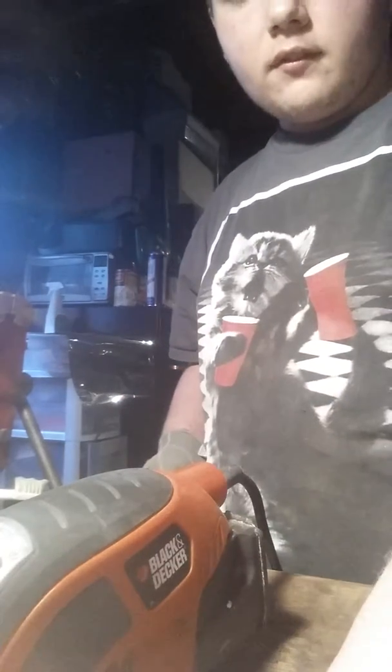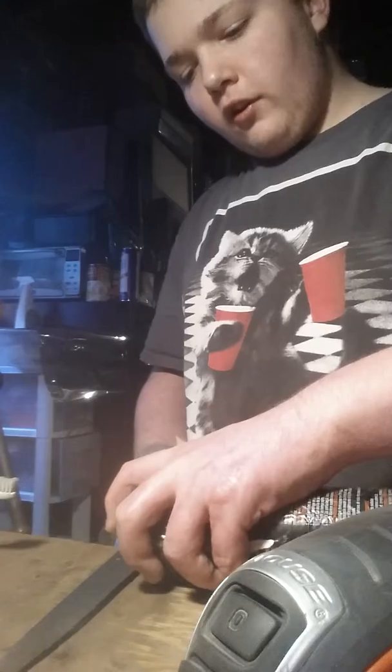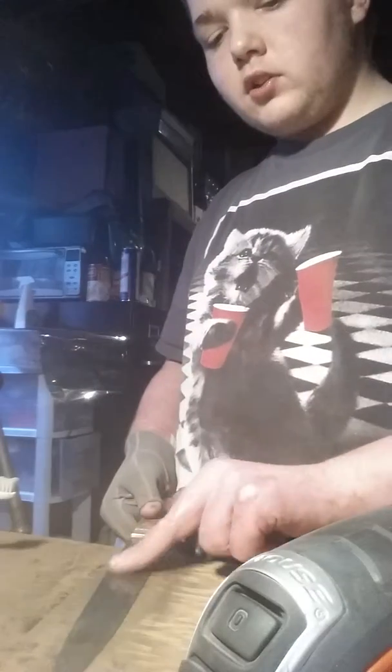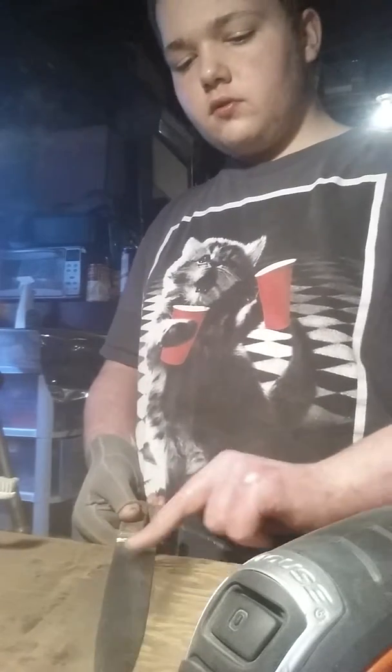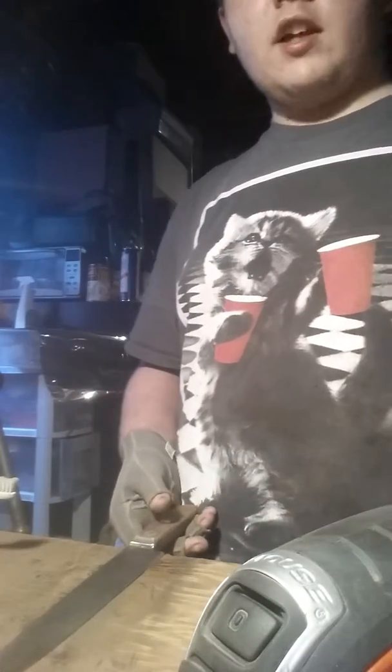I'm going to pause the video while I do that, and I'll be right back. And if you're in the middle and you notice you can't get some of it off, shake up your Tri-Flow or WD-40, spray it up and down the blade once, rub it in, let it sit for 40 seconds, and then go at it. And then I will show you guys what it looks like after that.